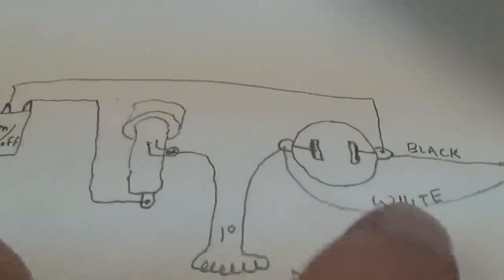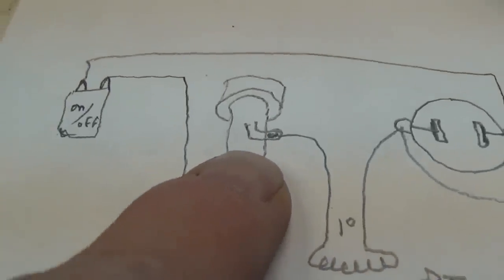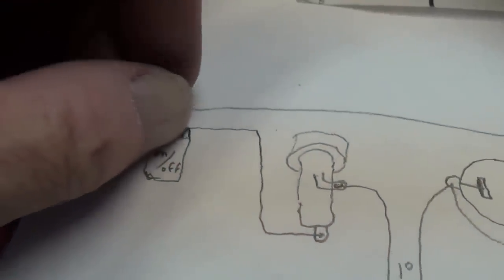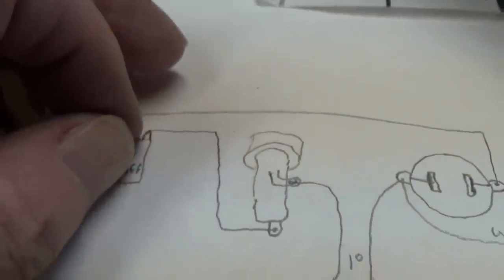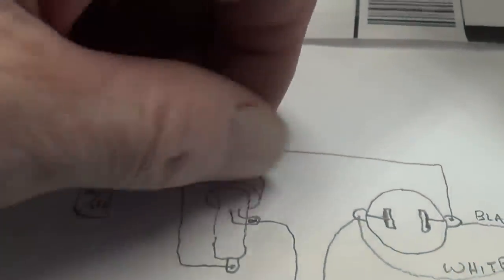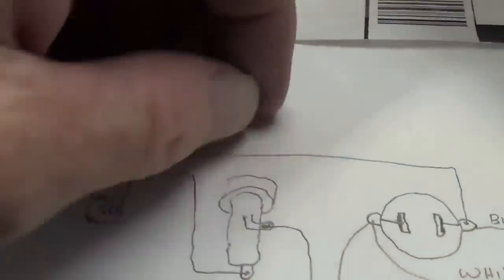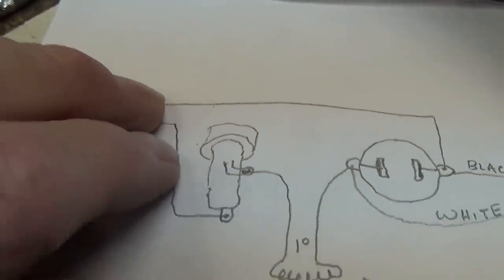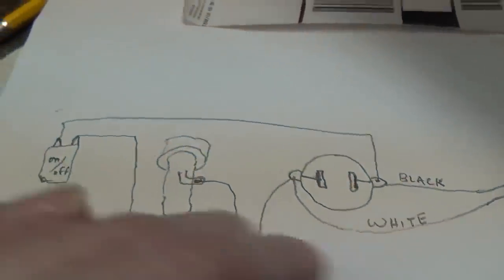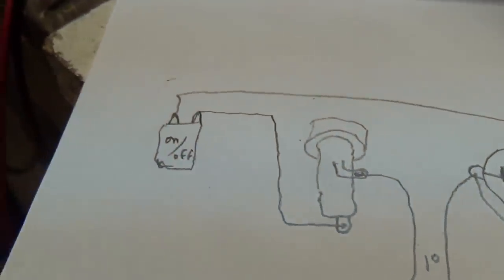Also, if you wire it that way and go to the fuse holder first, then you can come over here and say, I'm going to check the fuse in the amp. Flip the toggle off, feeling very safe, and unscrew the cap, grab hold of the fuse, and get one heck of a shock. And if you're touching the chassis with the other hand, which is grounded by the third green ground wire, you could be killed.